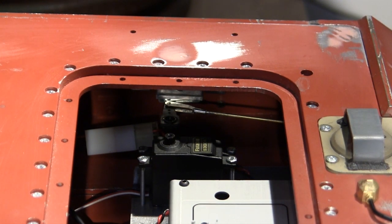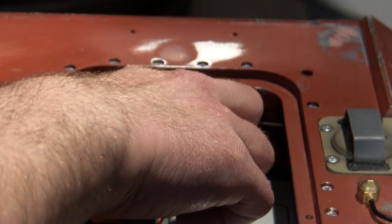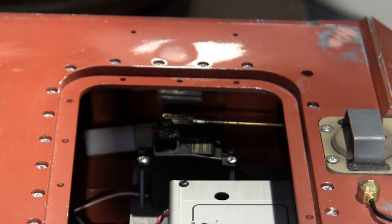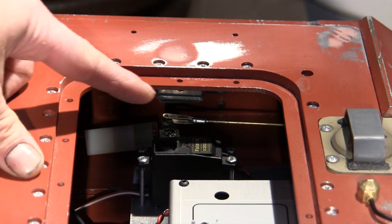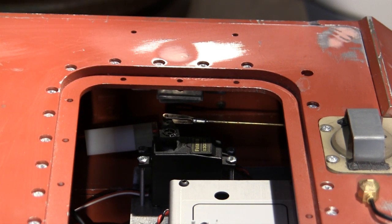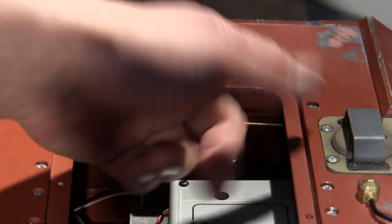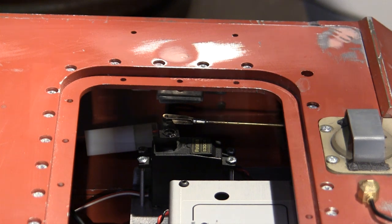The mounting screw itself is not really necessary. With the amount of grip that's found on the servo pivoting arm itself, as well as with the clevis, it actually does a pretty good job of keeping it in place with just friction alone. However, of course, I need to mention this: if you are working on an RC airplane or an RC submarine, yeah, you want to put that little retention screw in place. That's just, you know, nuts. However, for something really trivial like a small little pivoting animation like you see on this model here, not having the screw in place is something that is completely acceptable.